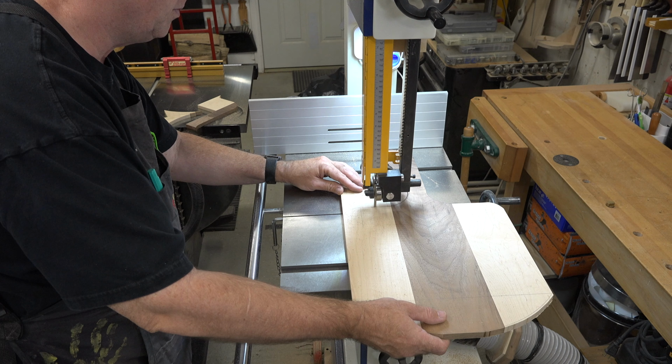In fact, I'm going to let it dry overnight. In about half an hour, 30 minutes kind of thing, because of the longer working time with Titebond, I'm just going to go along here with a scraper and I'll take off the majority of the excess glue. And like I said, let it dry overnight, and I'll see you in the morning.